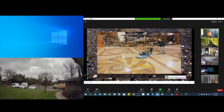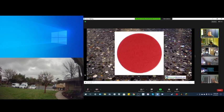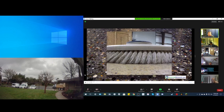The type of pad or scrubbing bristles is crucial, especially when you consider some floors are being cleaned on a daily basis. Generally, red pads are a good all-purpose cleaning pad since white pads are finer and tend to hold the dirt in the pad. Any more aggressive of a pad than the red is simply too aggressive. Soft bristled brushes like you see here are also considered acceptable.